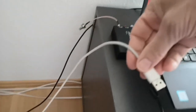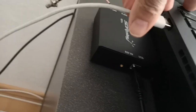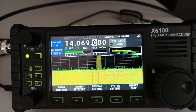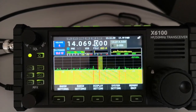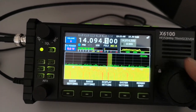Let's plug in the USB port to see what happens. That sounds and looks the same — so there's not so much USB noise coming through here. When I touch the trackpad now, you can see some noise floor going up and down, but it's not as bad as the V130 laptop, because this one has a better metal construction inside. But it has all these spurious signals coming out of it. I'm going to have to choose which computers I use for which frequencies and what kinds of uses. I think the T470S is not going to get used for radio purposes — I'll probably stick with the other ones. I do have a bigger laptop that's quiet, but I'm not going to hold it in one hand.